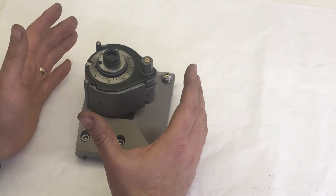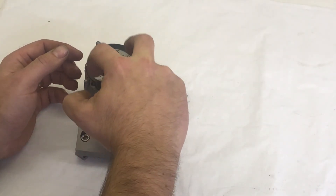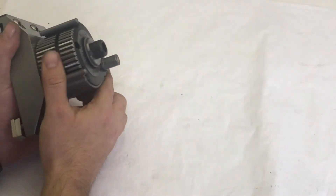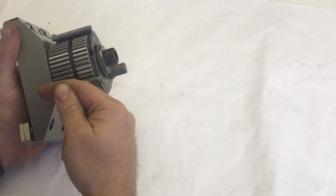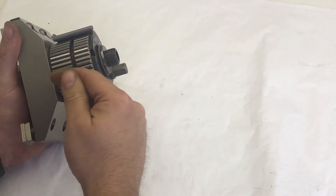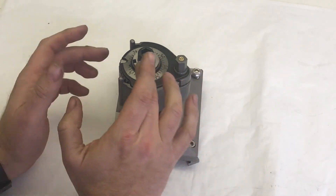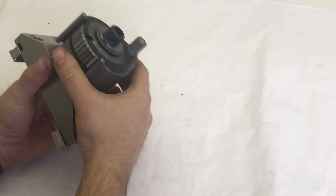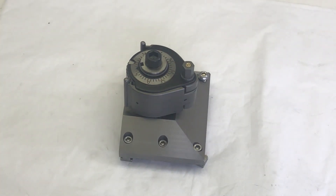Once I've got that in place, I'll take it off the lathe again. There are a couple of holes in the main post that go all the way through, so I'll set it up on the mill, drill through, and ream one of those holes, and lock it in place with a pin so that there's absolutely no way this can rotate relative to that. It's pretty sturdy and solid as it is, but that would be the finishing touch. So we're very nearly there — next time you see it, it'll be on the lathe. See you next time.